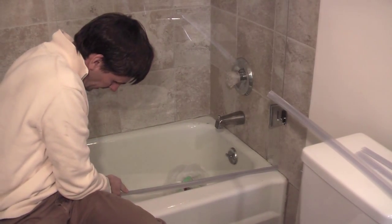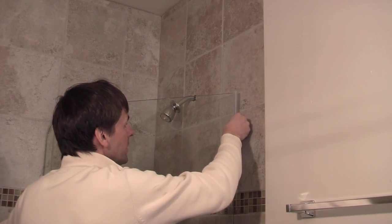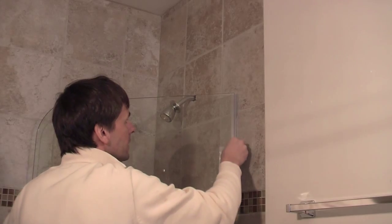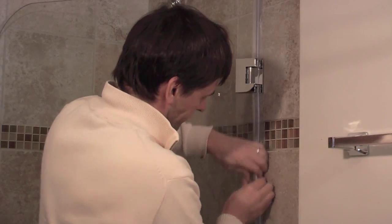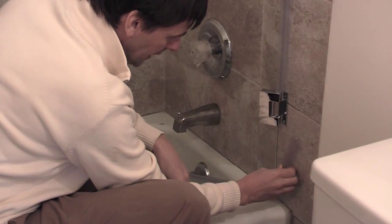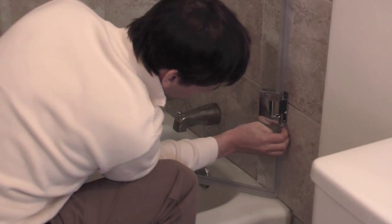The seal needs to be squeezed up a bit more at one end. The seal usually needs to be trimmed to length — the top one doesn't matter as much, but the two below need to be pretty exact in length since there's going to be more water aimed at them. Squeeze the top one on and you'll see it seals off against the wall. Push the bottom wall sweep right up to the hinge — this is the most important one. Run it straight down onto the bottom sweep, leaving the bottom sweep sticking inside the glass close to the wall. You can mitre both of them at the bottom, but it's actually slightly better to run them straight across like this.